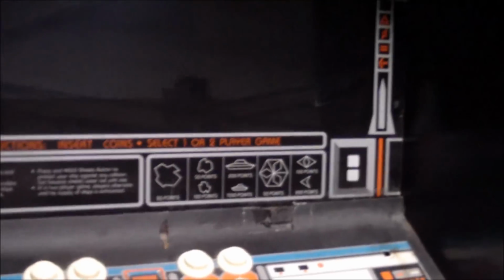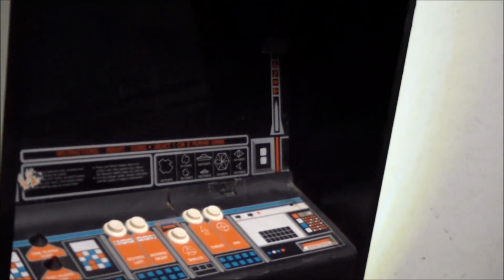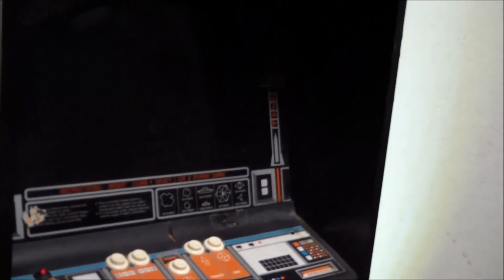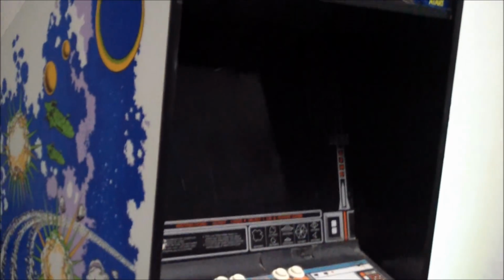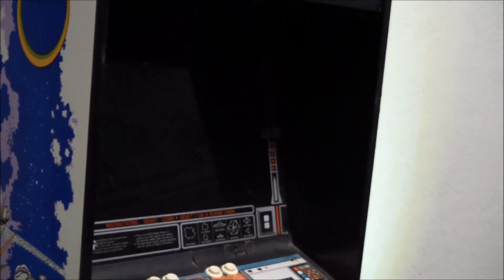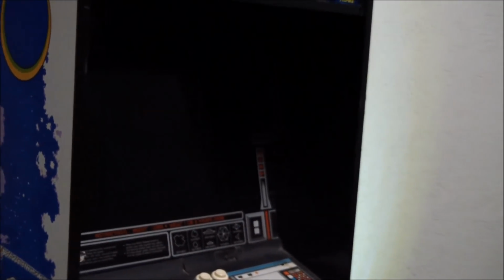And what I did was, these machines are famous for the connectors on the deflection board cracking the solder joints. So I went and played around with those connectors, and I briefly got an image. Of course, the camera wasn't running, but it was extremely bright. The intensity was turned all the way up. The Z didn't seem to work because everything was connected to each other. There never was any blanking. But that only lasted for a few minutes, and then the screen went blank again.